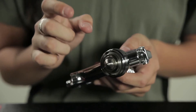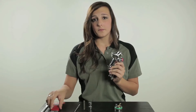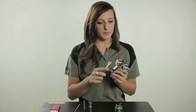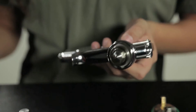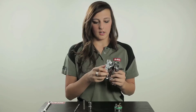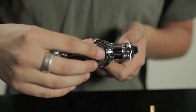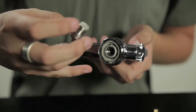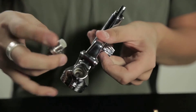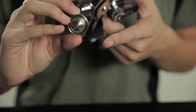This is your fluid tip. You have to make sure that you use the right tool for it — if you use a 12mm wrench, it could easily slip and you could damage this fluid tip, which will cause your spray pattern to be uneven. So we take this off. The whole fluid nozzle sits inside the material passage. The material flows through it, and this is where the material comes out of your gun.